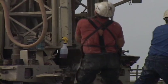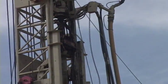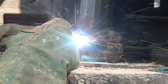Forcing casing down pre-drilled holes at a later time can cause costly damage to the casing or shoe. Using the Weldco-Beales hammer, casing simultaneously penetrates the hole directly behind the drill bit, minimizing excess strain and forces that can potentially damage the casing or shoe.